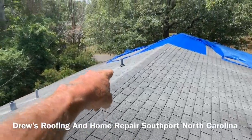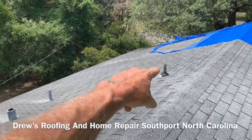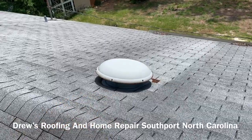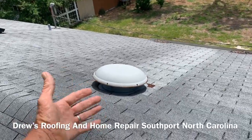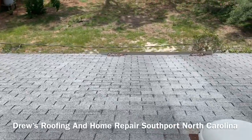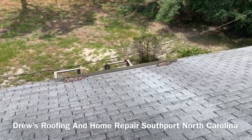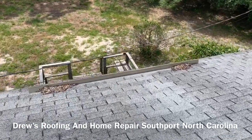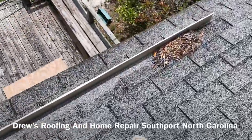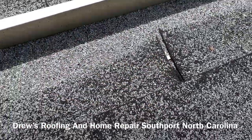You're going to need to go to these things here. I would just go to Lowe's and get the regular standard pipe boot. If you need a new one of these power fans, you can get one — I recommend replacing it with something solar. It looks like it's got a rain guard, so there's probably a door down there. And if you don't make these rain guards right — and I bet you money this one's not — the L-shape has to go up underneath the shingle, or it's not really doing anything but letting water underneath.